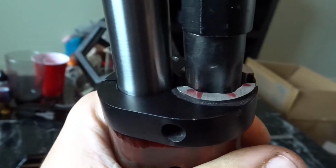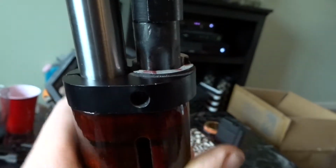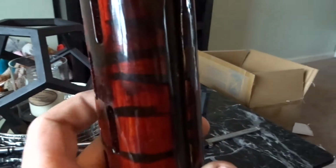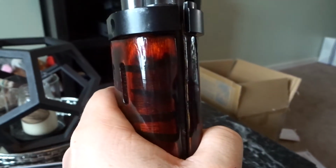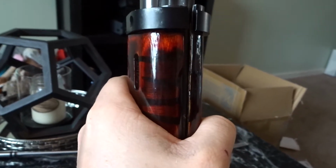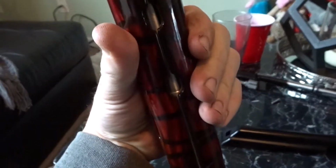We still have to get a little deeper and get those cuts around that gas tube, and we'll probably have to notch the gas tube in order to get the screw to go through. But you can see what we're dealing with. To get it to fit up here, we had to trim inside the handguards, and I'm going to have to trim some more to get it to fit okay too, because I don't want these straining around here. A little bit is okay, a little bit of tightness just while you're screwing it down, but I don't want it to be that hard. So we still have some work to go, but the bottom fits just fine. You can see the bottom comes right in, no problem. And that one's good.